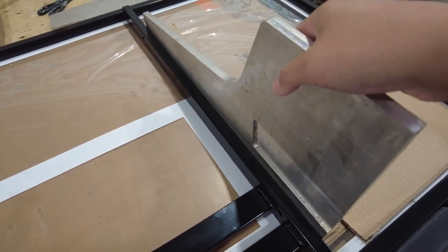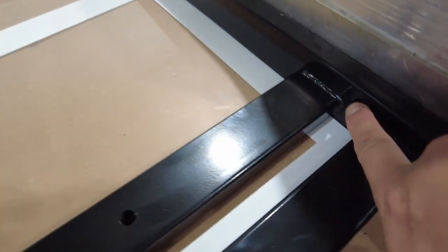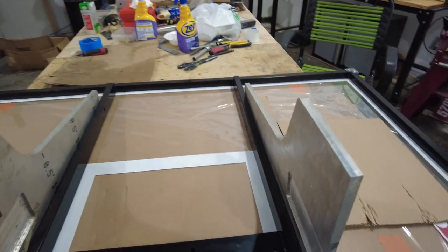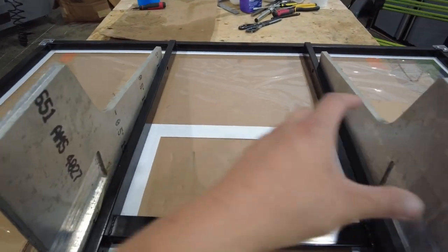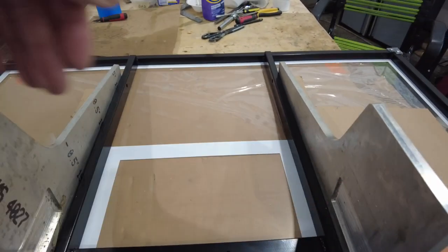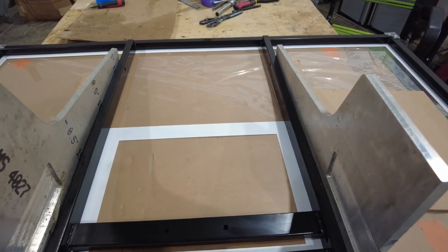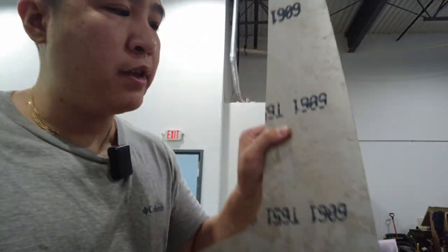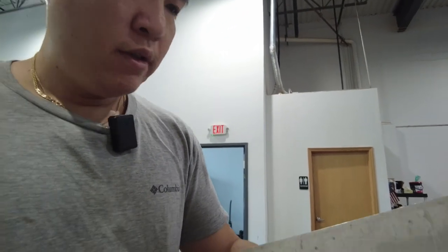This part is going to go something like this on both sides. There are already two holes that we can use to mount the plates. So now that we have these two plates attached to the backboard, I'm going to machine a crossbar that's going to attach to both of these plates, and also have the slots inside where the forks of the forklift can go into. We're going to bolt it and tighten it from the bottom and on the sides. The first thing I'm going to do is face this off with a spiral pattern so it can look better, instead of having the 6061-T6 print on the side as well as the unprocessed finish. I'm going to put this in the machine, surface it, and it's going to look nice and nifty.